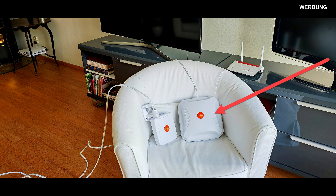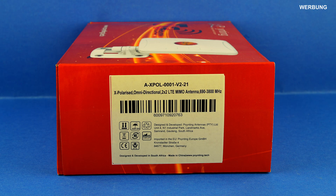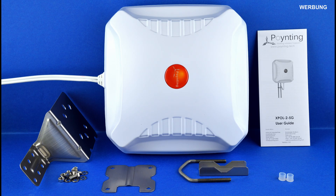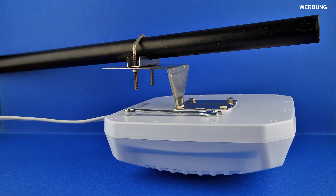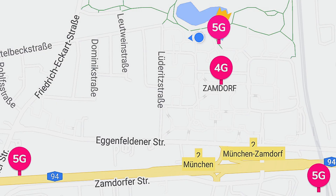For the sixth round of measurements, we also prepared the larger directional antenna X-POL2 5G for mast mounting. Unboxing, tech specs, scope of delivery, antenna gain, radiation patterns, and other basics of both antennas have already been covered in detail in the last video — we won't repeat that here. Today we only screw the included mounting material to the directional antenna with a 10mm wrench, reconnect the wide antenna cable to the two SMA sockets of the 5G Fritzbox in the radio-hostile concrete chamber, then turn the large directional antenna toward the well-supplied trade fair highway.